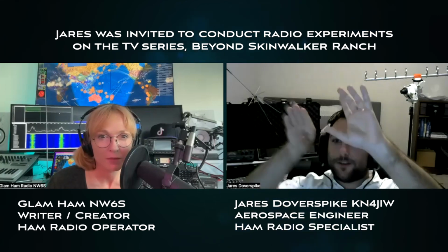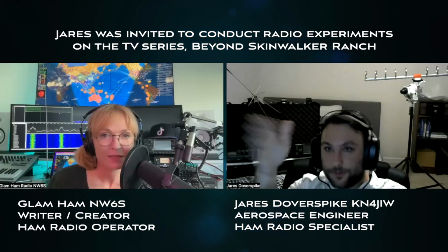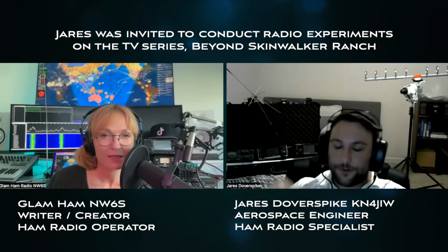Also, there are some apps that will tell you what's in the sky. You can also take a look at aircraft. They have all the radios that are sending down, and you can see those on your SDR radio as well. These apps will tell you where different satellites are in the sky, and you'll be able to point your antennas in the same direction, because it's not pinpoint. You do have a little bit of a radiation pattern that you're able to receive from, so you have a couple of degrees of slew to work with.